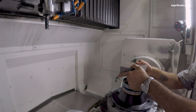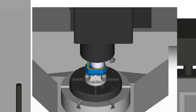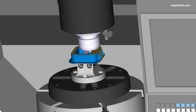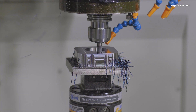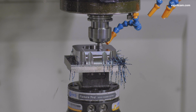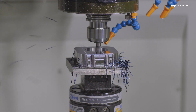The way profit milling works is with a light radial engagement and a full depth of cut. Decreasing the radial engagement of a cutter allows us to increase the feed rate. The cycle then dynamically adjusts that feed rate throughout the cut in order to maintain a proper chip load on the tool. This increased and optimized feed rate is really a big reason why we're able to achieve such dramatic cycle time reductions.